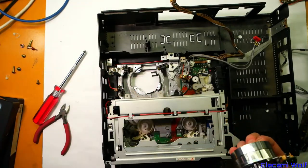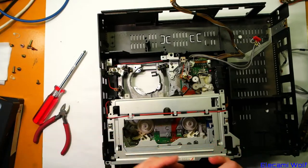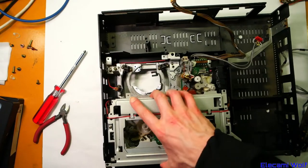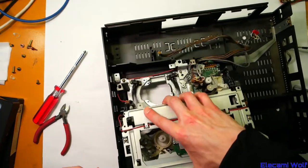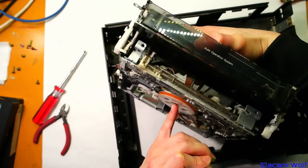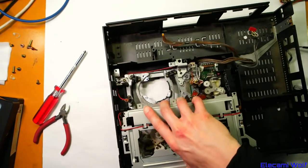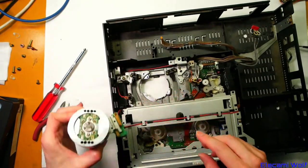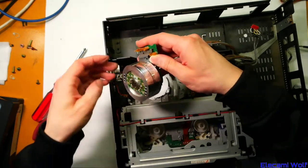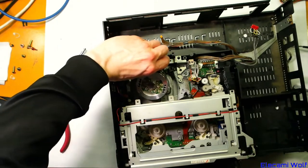You're going to watch using a tissue near the heads because it will rip fibers off with the head gap, so just be careful there. We'll clean it properly once we get it installed. I'm going to dirty it again by putting it in, so... this sticks down quite a lot, so we've got to leave it in something or prop it up to run it. Let's just leave it in this housing for now and lay this in.